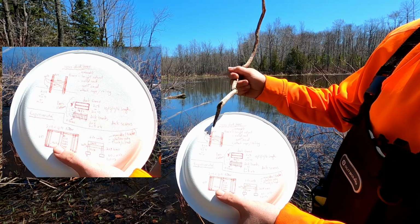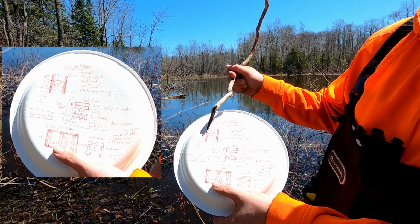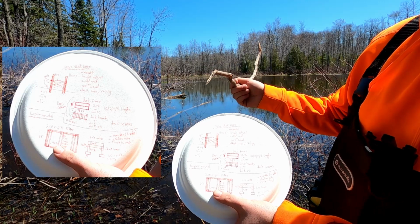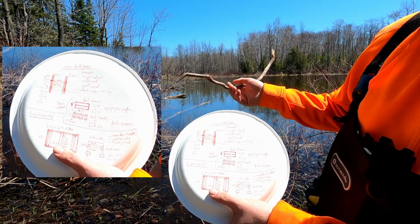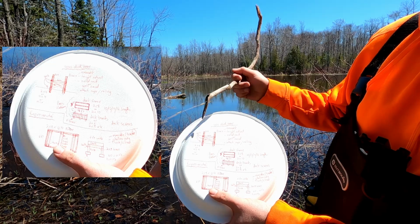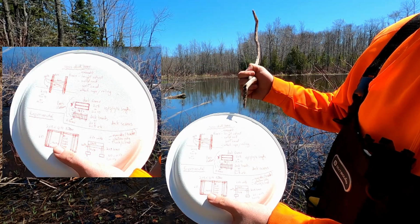The plus of having this kind of bracing with a dock going across the middle, so you'd have at least two of these H-frames for a 12-foot or 16-foot dock, at least two. 16 feet, I want 3. The benefit of this is that it's removable in the winter. It's height adjustable, so if you have to put different bolt holes here or there, you can have 2 or 3 different bolt holes that you can reuse again and again. Again, much stronger than screws.